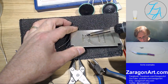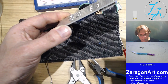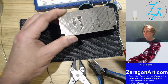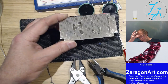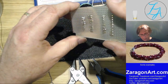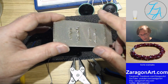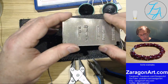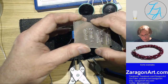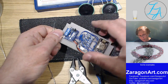That joint that's next to it, there we go. The joint that was next to it, that I'd just done a minute ago, didn't actually look that shiny. It looked dull. That usually is an indication of a bad joint, something called a dry joint. It means it hasn't really soldered, the solder hasn't really flowed in and bonded correctly. And if that happens, it's likely to break and or just be high resistance.